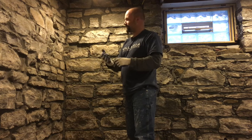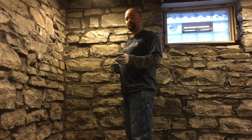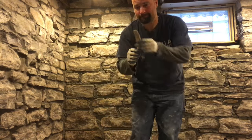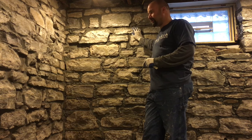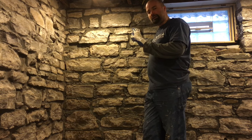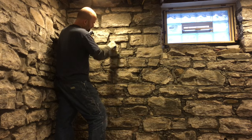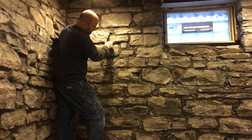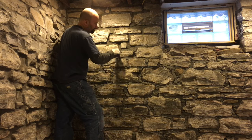As you can see, I have filled this with mortar — I did about half this wall this morning. Just got back from lunch and now I'm going to use my gloves and a stick tool to smooth down the joints. We're going to smooth down the mortar while it's firming up — not dry and not sticky wet, right in the middle.